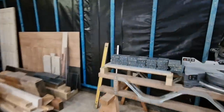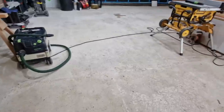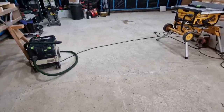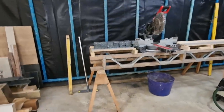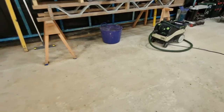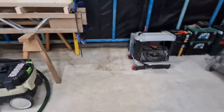We're going to put the sole plates on plastic shims. There's no damp or moisture in this concrete but it's kind of a psychological thing — I always like to have some sort of separation between timber and masonry. So we put them on there like little feet, then make a T-section which goes on top to get our sole plate up to the right level. It's a really nice detail.